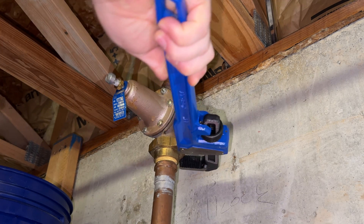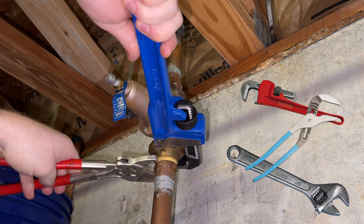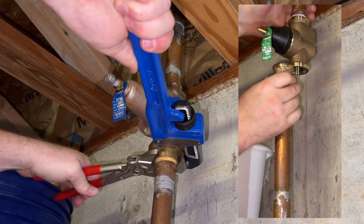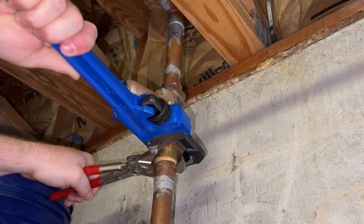This is one inch so you're going to need a lot of torque. I'd suggest a pipe wrench, but pliers or an adjustable wrench over 12 inches should work. Figuring out union nuts can be tricky. The way I picture it is the nut has to slide down the pipe so we have to reverse it counterclockwise — just a good old lefty loosey if it's like mine.